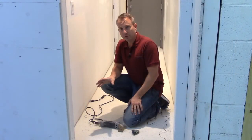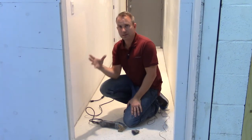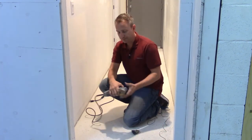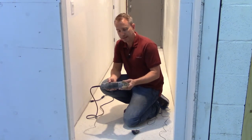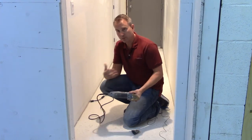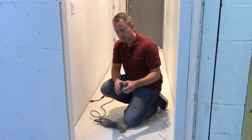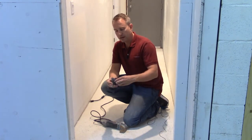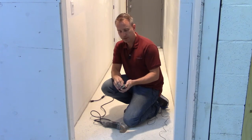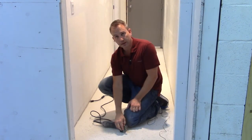One of the challenges you'll run into when edging is what to do around door jambs and in corners, because the wheels can't cut in there. A tool that will help with that is a small oscillating tool like this. We have a rasp attachment for coarse grinding to remove any paint or contamination. Once that's done, you can put on a Velcro backer with any of our resins and work up through the tooling for your fine detail work.